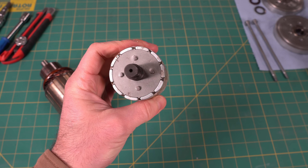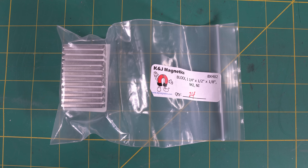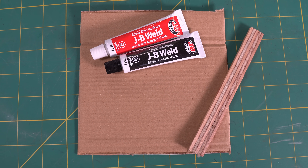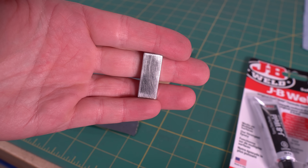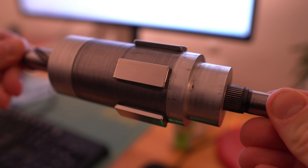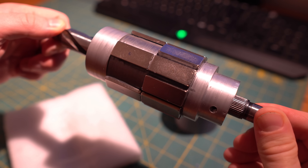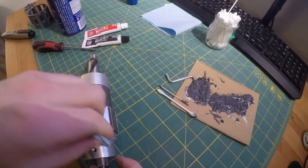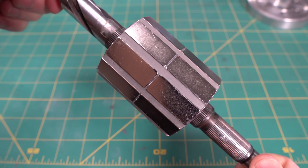The rotor of the brushless DC motor consists of arc magnets, but I was unsuccessful in finding arc magnets with similar dimensions. The closest I could find were grade N42 block magnets that are one and a quarter inches long, a half inch wide, and one eighth of an inch thick. I'll be gluing the magnets to the rotor with JB Weld due to its high strength. Before gluing them, I used sandpaper to roughen the surface of the magnets for a stronger bond. I designed and 3D printed jigs to ensure the magnets are glued in the correct location and evenly spaced. I decided to glue just 5 magnets at a time, and also used JB Weld putty to fill in the gaps between the magnets.